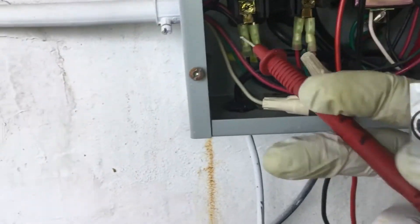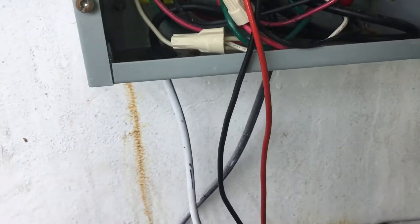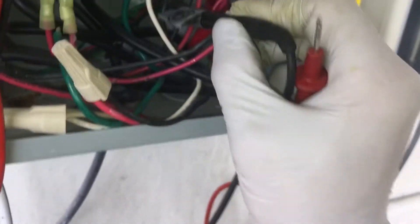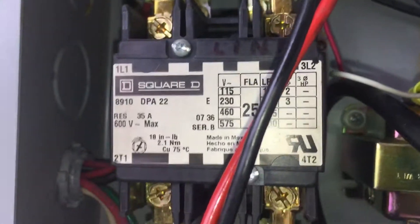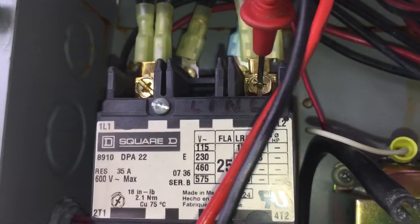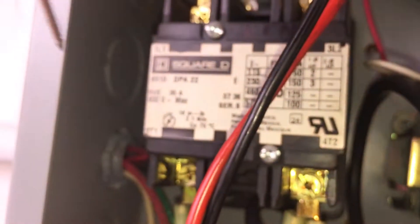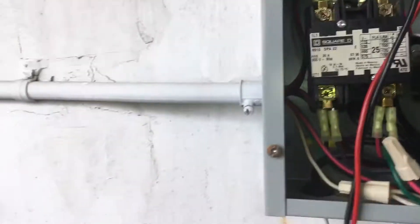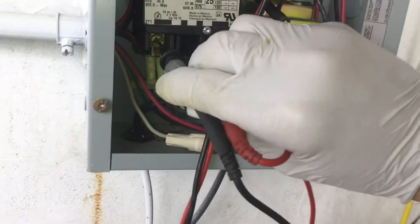Let me find a clean ground somewhere. I see a ground — I don't know if it works or not, let me go back to that ground. I'm putting my meter to the ground and looking up there. I got 120 volts. Touching various points — 120 volts, 120 volts, 120 volts. Everything's 120 volts and it's 208 across the line.